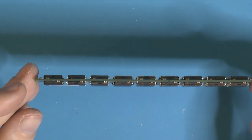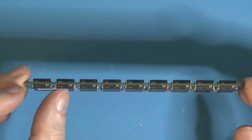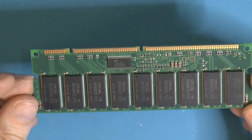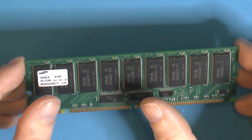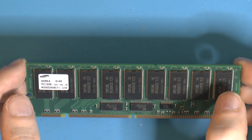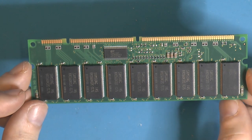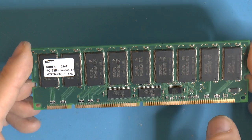The way they got that in there is these memory chips are actually two per side, stacked. So they look kind of funny. You can put them under a microscope and have a look. Because it's ECC and registered, there are 9 modules, or you could call them modules in a module, because there are 2 ICs here. So they're actually 18 per side, but they take up 9 slots like you would expect ECC to do. So there are actually 36 memory chips on here, and 144, I think, total for the whole system.